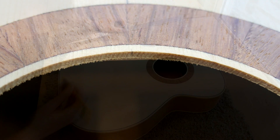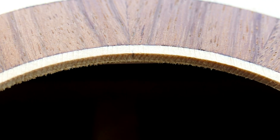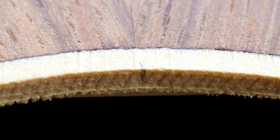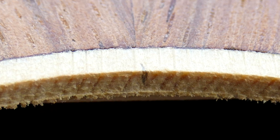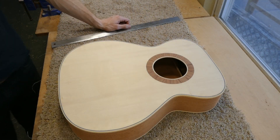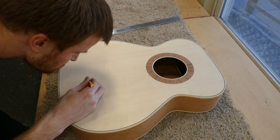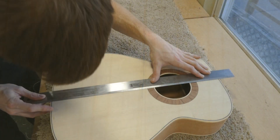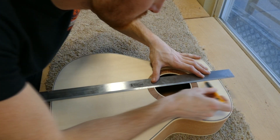At this point with the binding in place it can be extremely difficult to find the line. Sometimes the best place to look is on the edges of the sound hole, where the glue line reveals itself as the angled grain line disappears. You can also look for anywhere on the top where two grain lines converge into a V shape. Then I connect the marks with a straight edge.